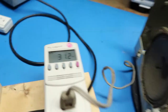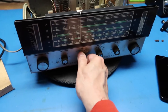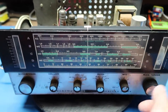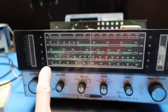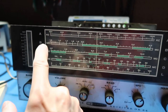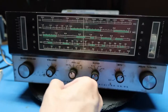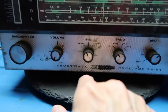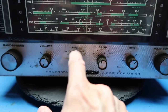Let's switch bands. This is still going down, settling in towards 31 watts. I see this meter jumping around as I change bands. So the way this works is you've got these A, B, C, D, and L bands — those may be standardized in some way, I'm not sure. KC means kilocycles, which we would now say kilohertz. MC is megacycles, which we would now say megahertz. So band A is actually the AM band I think. And here we've got our option of AM, standby — which is kind of a mute setting — and CW.